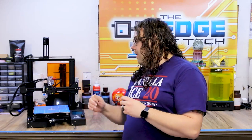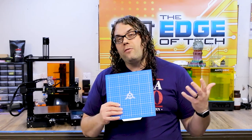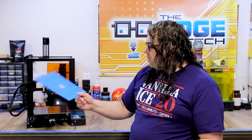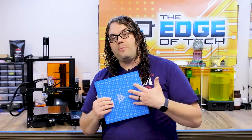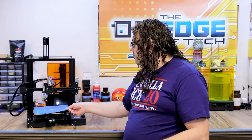I think you'll really like upgrading your printer if you haven't already. If there is one upgrade I would suggest, it's the Easy Flex. Do some sort of flex plate with some sort of base — this right here is the Easy Mat. They have a new version, but you stick it down to the flex plate, put your magnet on the bed if it doesn't have one, and throw it on. Just give it some flexes when you're done. I have them on all my printers now — a lot of them I've swapped to the Easy Flex 2 with the textured PEI surface. They all work really well. Ten minutes or less and it saves a ton of prints and time trying to scrape stuff off.